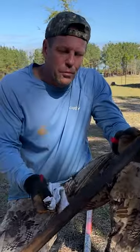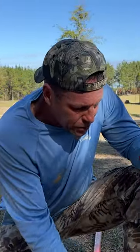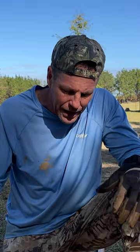All right folks, that was a teachable moment right there. I didn't think about this thing rusting — it was grease. If you're ever gonna leave your PTO shafts outside, you need to take them apart completely. It's always easier to hit them with a wire brush and then lube them so they go together, than to do what I just did, which is pull them apart.